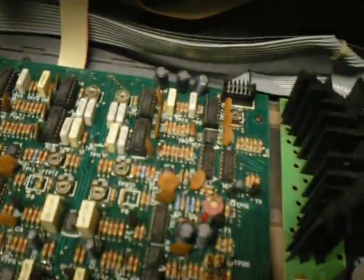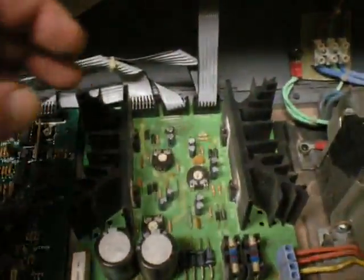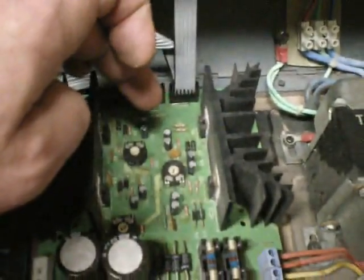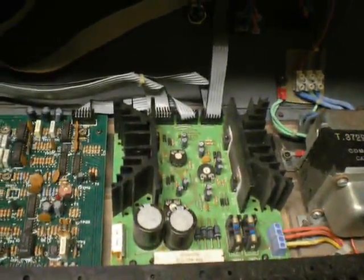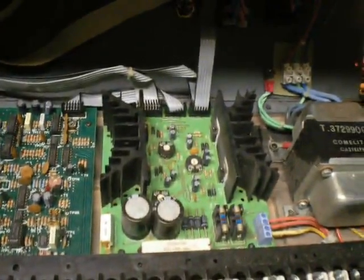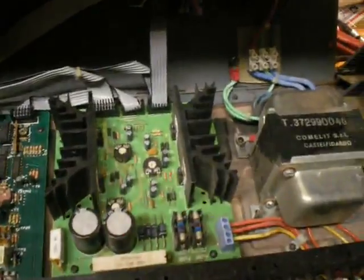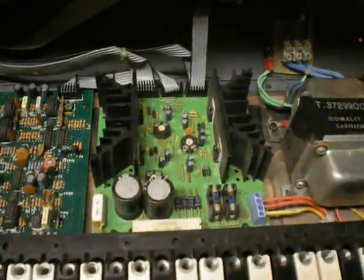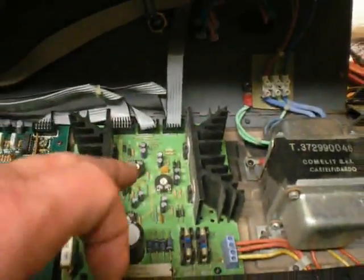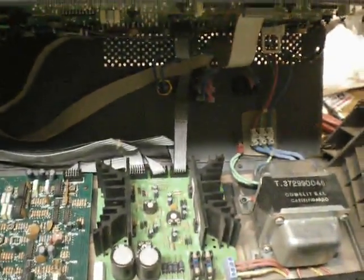These don't go bad very often — I've only seen a few resistors fail, and they'll cause something to do something strange. Difficult to find sometimes if something does go wrong. One more thing I recommend: chop R7 and put in a 100-ohm resistor so you can change the 5-volt level. These often will have pretty low voltages in them — sometimes they get so low it can cause some issues. Not too bad to have a 5-volt adjustment — just put a 100-ohm pot in series with that. You could tie it over onto the second wire there connected to R7's side, to extend the range of that resistance.